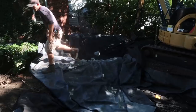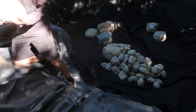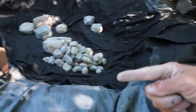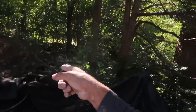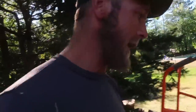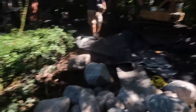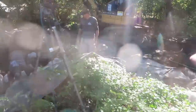We've got about four tons of boulders already staged back in here. Jack, Dan, myself, Louise, and a new guy Seth are here today. We're going to go ahead and rock the entire pond in and work our way out, with the machine sitting relatively close so we can strap up the big boulders if needed. There's going to be a brick wall back over in the little cove area, and we'll have circulation jets with pipe running back behind that wall. We already have our plumbing hooked up to the Bio Falls. We're either going to upsize the pump and manifold off somewhere back here, or come in with two pumps and add a supplemental pump for those circulation jets and the really cool statues we're going to incorporate. We should have this pond pretty well licked today.